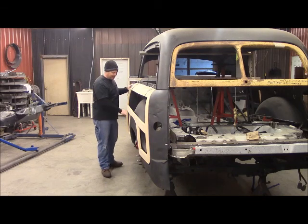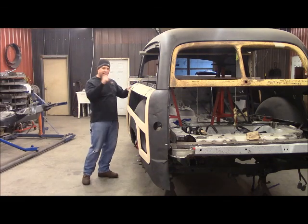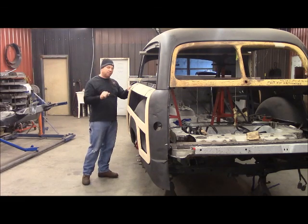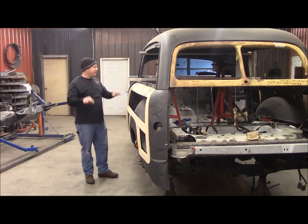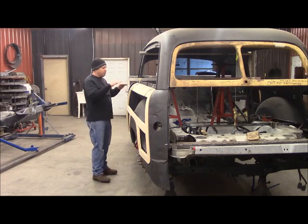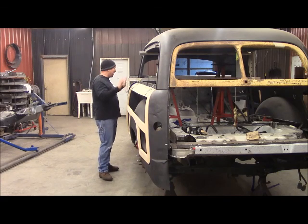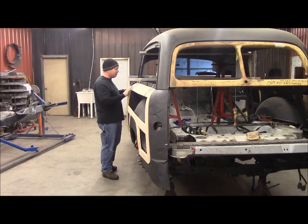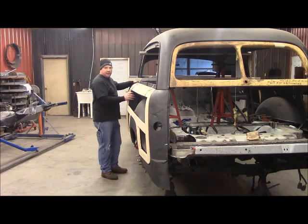So I'm at 5.5 inches off of the plates that I made, and that fits beautifully. So I went in here on the other side, made another 5.5 inch spacer, put it in on the other side, locked it down. It was right on the money. So I've got a good number here. So now I'm going to work on getting the height. I can move this post up and down and this one up and down, but I think they're in the right spot, but I'm fixing to make all the checks on that so they're in the exact spot. And get done with that, and we'll start building some outriggers. So let's get to work.